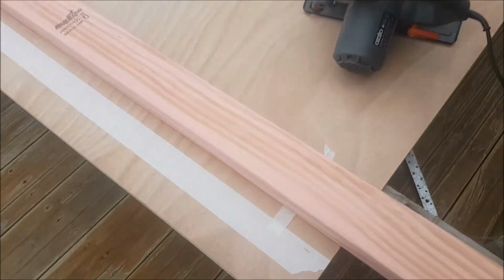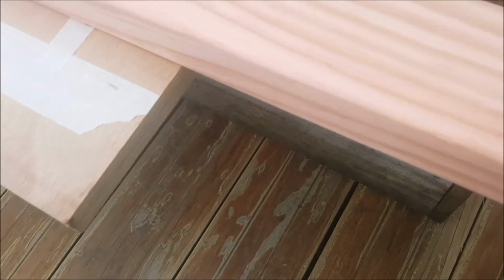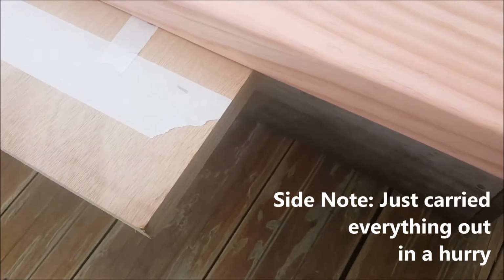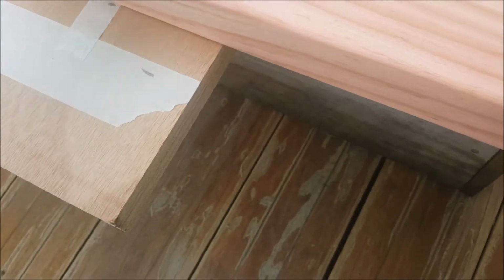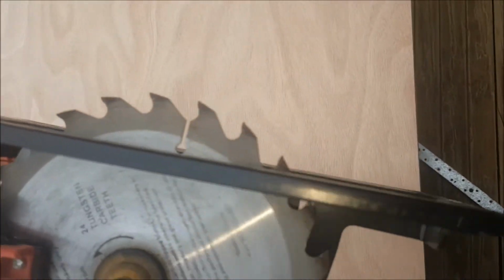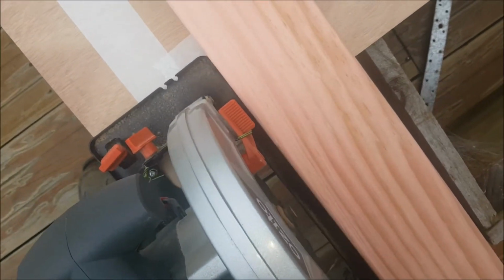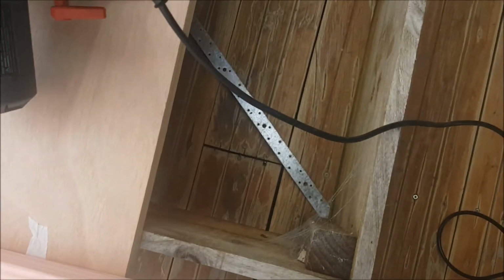First we're going to trim off the top, and both of them need to lose that top. It will be 2 meters 31 total length, so about 9 centimeters needs to go. And here I've got a straight beam, and this distance here is exactly 34 mil, which is what this blade is away from here. So the idea is to set that up, push it against this, clamp it down of course, and just go with one swoop, cut it off.